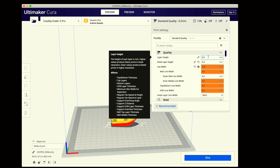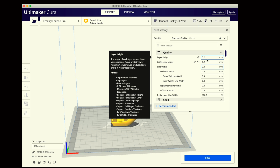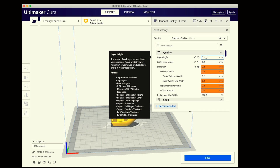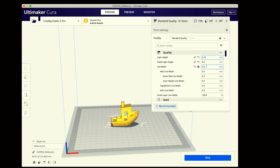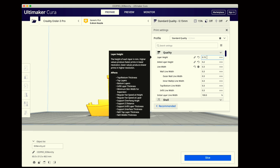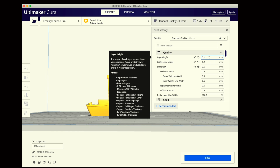You also have to change the layer height. The layer height is always going to be half of your nozzle size. With a 0.4 nozzle the layer height is 0.2 — that's half. Since we're going down to a 0.2 nozzle, the layer height will be 0.1. So the rule is: layer height = half of nozzle diameter. For the 0.3 nozzle our layer height will be 0.15. This ensures every layer is exactly half the bead width the nozzle can make, giving the best quality.